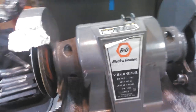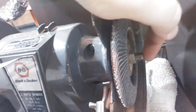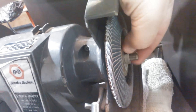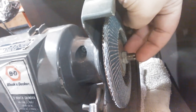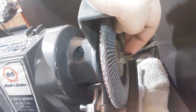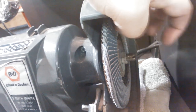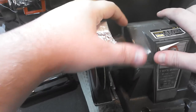And so what I've chosen to do, now I do Locksport hobbying, and on this side you'll see this is a half inch arbor shaft. So on this side there's actually a, see here, this is the slit. So if you're untightening one side of your grinder and the other side is not coming out or coming loose on you, this is why. So you stick a screwdriver in that, and that will allow you to break the other side loose. You don't have to take apart the top.